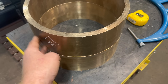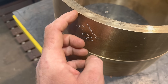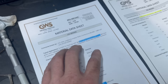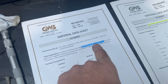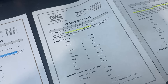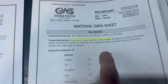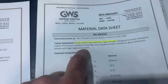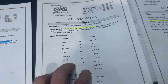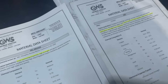This is the phosphor bronze we're going to be working with. The length is one mil over, which is great — got a little bit of wiggle room. We're at 123.3 so we've got a little to take off to get it to size, and I've got to be exact on this on both of them. The reason we're choosing phosphor bronze PB1 over LG2 leaded gun metal: LG2 is good for light loads and low to medium speeds but isn't very hard — Brinell hardness of 60 — whereas PB1 phosphor bronze is 100 to 150 in hardness, with good machining properties, high strength, good corrosion resistance, and it's better for high-load bearings. We could use aluminium bronze AB2 but PB1 is better when there's not as much lubrication.